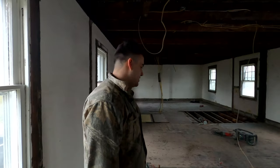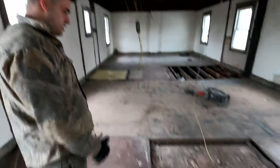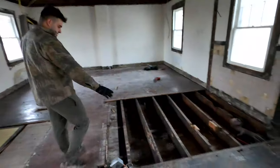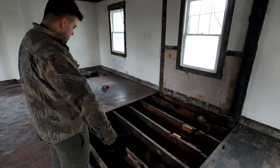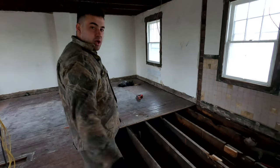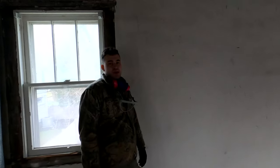Welcome back, we got some framing going on in this video. We're gonna put a whole new floor down, but to do that we gotta do a little prepping first. We're making sure there's no squeaks in the floor, screwing down any spots. We're gonna frame this old fireplace up to make it even with the floor, and over here we got some hacking of the old floor joists - we're gonna sister some new 2x10s up to it and put a new floor in the bathroom. We're gonna get 26 sheets of plywood and head to Home Depot now.